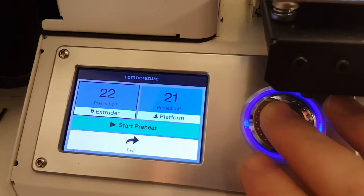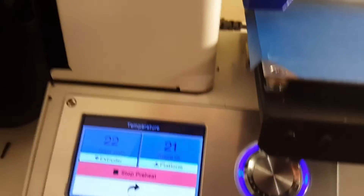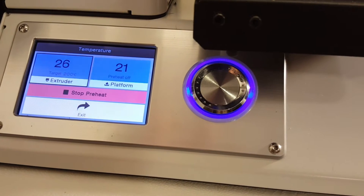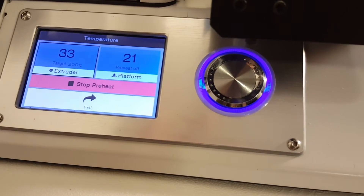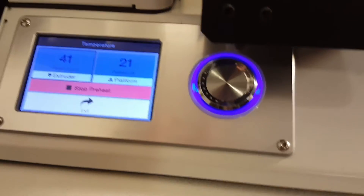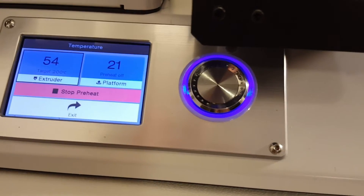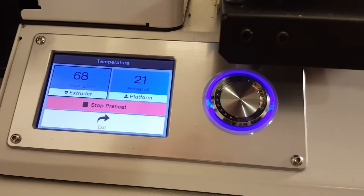The last material I printed was PLA, so I'm just going to preheat mine to 200. The other reason to preheat the nozzle is that in some cases you could actually have a little bit of expansion in the nozzle. The way I look at it is that if we've got the nozzle in exactly the same condition as it's going to be when your print actually starts, we're going to have the greatest chance of having a really successful bed leveling and thus really successful prints.